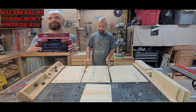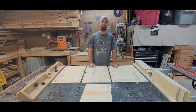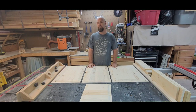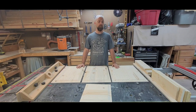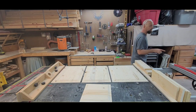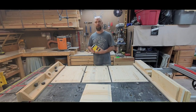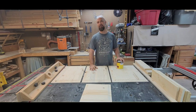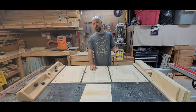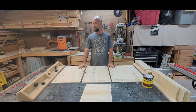In my last video I showed where I cut the edges of the panels using a Harbor Freight rail and stile bit and panel bit. Today we're going to stain the edges, get them fitted in a frame, and start assembling the nightstand. I'm using the same stain as the bed - Minwax dark walnut - it made the bed look real good, and we obviously want the nightstand to match. We'll be using the same stain on the dresser too, so stay tuned for that.